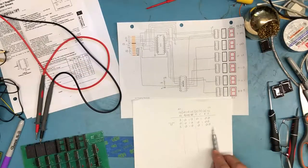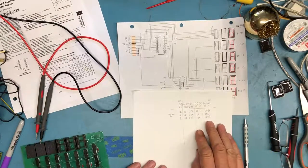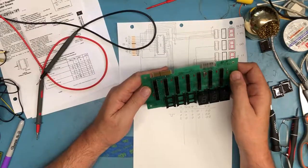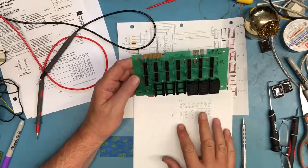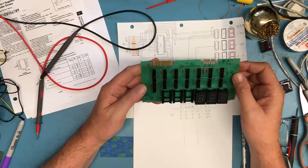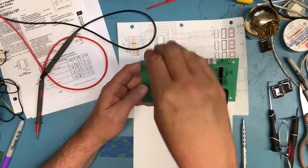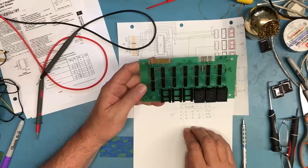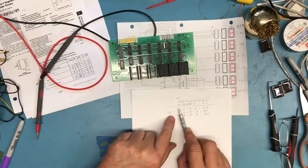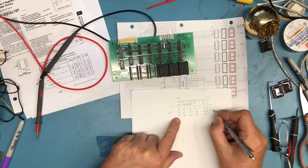So really, all I need is 8 control signals, or a single byte, to control this. I'm guessing this is pretty much how it was designed to be used. Whatever device it plugged into, I'm guessing each one just used a byte to control it. That byte could be memory mapped, like with a microcontroller, or it could be on a port. It just doesn't matter. Anything that can manipulate 8 bits. If it was memory mapped, it would need latches to drive it, so I'd probably do it with a port driver that latches. But on the PIC, I can designate 8 pins as output, and just through bit manipulation control it. I will call this a write cycle.